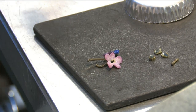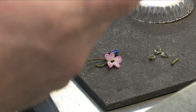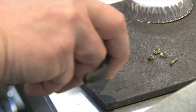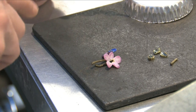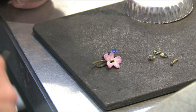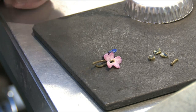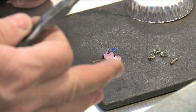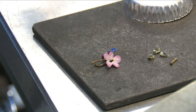So try to work from the inside out. Make your attachments correctly, and do as much shaping and sizing as you can while holding it like this, before you actually commit to putting things together. Because the more times you heat that joint and move that joint, the more stress you build in it, the more it wants to explode all by itself. So you'd like to get it set up cold.